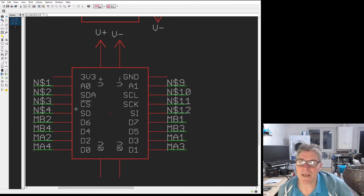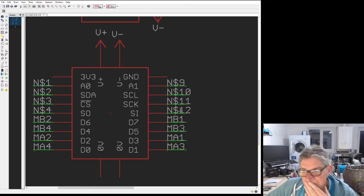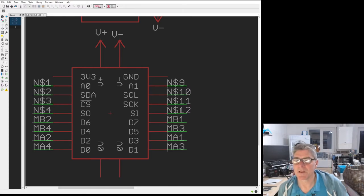The other thing you've got is an SPI. That's useful. So for example, if you're talking to a motor driver, that may be the way that you want to set the various parameters on the motor drivers. So if you're doing a brush motor, brushless motor driver or something. And then we've also got SDA and SCL. So if we need I2C, we can use this to do any number of things. We could use it to do identity of the board. We could use it to connect to a peripheral on the board. Likewise with the SPI, really. So if we needed to add more A to Ds, for example, or maybe want to add a DAC or some other peripheral that was SPI based, it's easy to add that on.